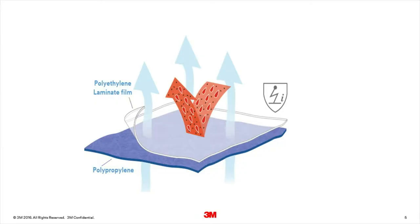Laminated fabrics are made with a substrate layer of non-woven fabric, which has a film of polyethylene on the top or outer surface. This polyethylene film is laminated to the substrate layer using a thin layer of adhesive. Within the range of 3M protective coveralls, two types of substrate are used. The first is a substrate made from a polypropylene non-woven to which a layer of polyethylene film is added. This type of fabric is used in the 3M protective coverall 4510 and the 3M protective coverall 4570.